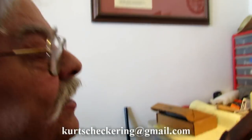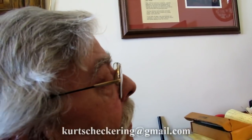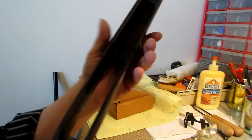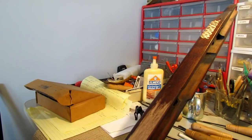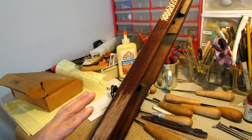What happens if you go against the grain? Bad things — scratches stand out. With the grain, they're basically not noticeable. So once you've got it all sanded down and it's nice and smooth, then go over it with a 400 grit. So the process is: start with the knife, then move to 200 to 320 grit, and then 400 grit to smooth it up.